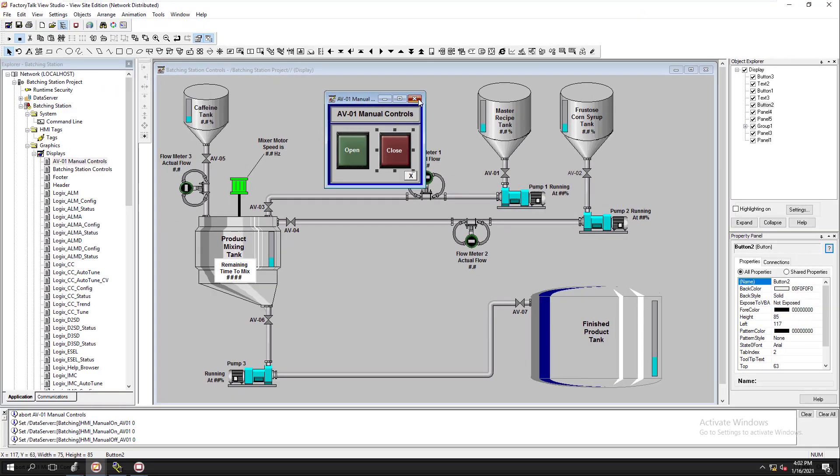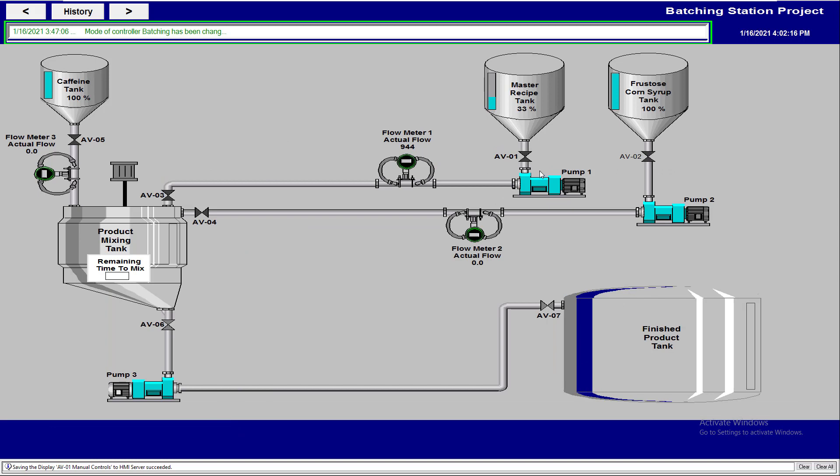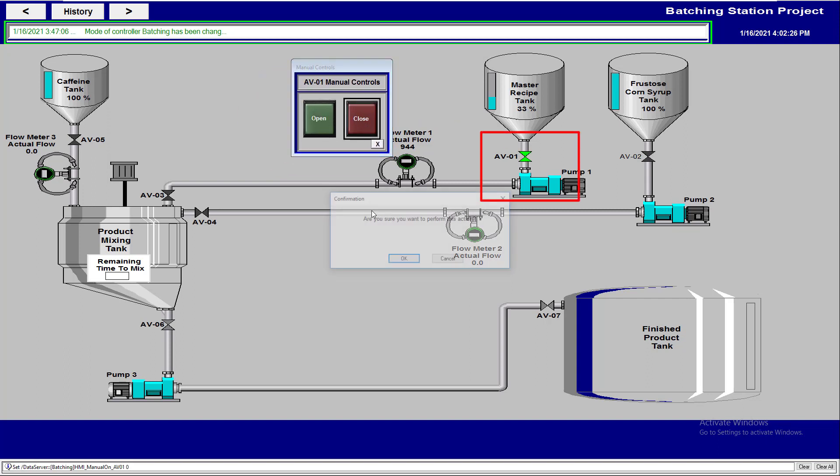Since this is a pop-up screen, we don't have to start the client again — we just save the screen and then open it back up. Now it should index on. If you see the way that works, it's going to issue a zero now, or issue the one when I hit yes — because I'm confirming based upon the release of the button. It's kind of coming up and saying 'Are you sure?' — the operator takes responsibility saying yes, I do want this to happen.